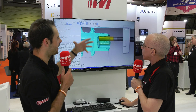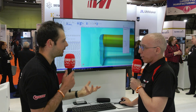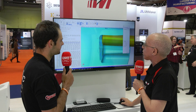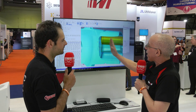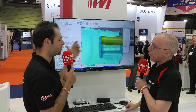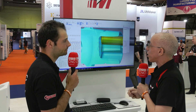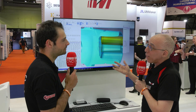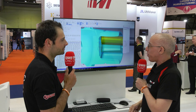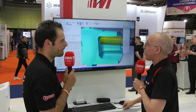Once you start stepping up the sides, you're going to get some Z-level scallops that you'll then come out and ball nose machine. Absolutely — this one will go in Z-steps going up the side of the part. We have the big step down, and we can set a separate step-up value as well. Another thing that's quite useful is climb milling only. You can climb mill, conventional mill, or zigzag between the two. Climb milling is quite a popular method, and we have the options in our strategies to go any way you like.